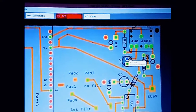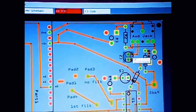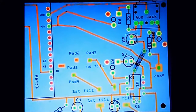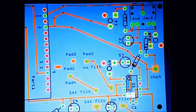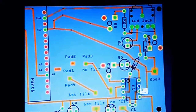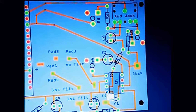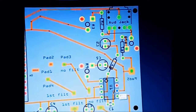Signal is coming out here, and it goes into a capacitor, which is, I'm not sure what capacitor I have put in this schematic. Probably, I think, oh god, I have to have a look. I think it's 1uF, and it goes through 83k right into pin number 3 on your LM. Your LM is turned up this way, you have that little mark. That's your pin 1, 2, 3, 4, 5, 6, 7, 8. 7 is bypass, and we don't need it in this example. So our signal went into pin number 3. Number 2 is one of the inputs as well, but it's attached to the ground. Ground is attached to pin number 4, and pin number 6 is 5 volts that we get from this as well, and we power our LM.